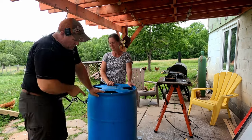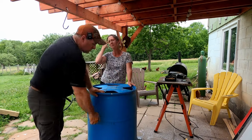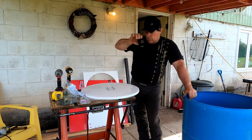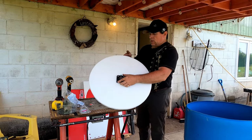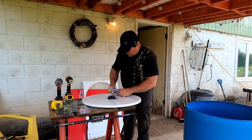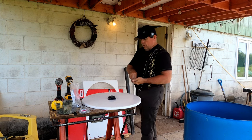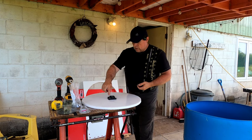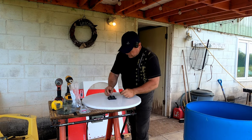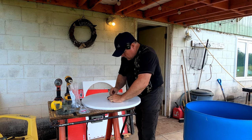I'm going to get some stainless steel screws with flat pan heads so they'll catch better - I'm afraid the others are just going to pull through. I'm putting this bushing in and as you can see it goes straight through. It's very important when putting these on to get them centered; if it's not centered it will wobble and wreck the chicken plucker. I use stainless steel bolts and nuts to keep everything from rusting.